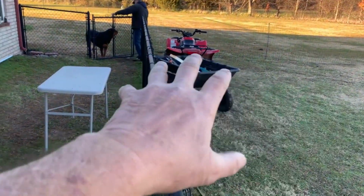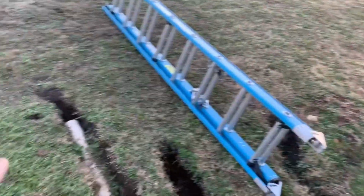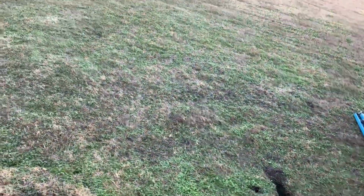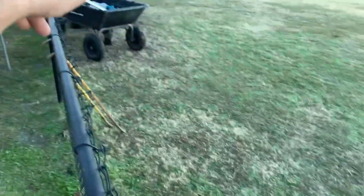This part is not going to happen until after the block wall goes in. This part over here, though, once we get the main water line that's coming around the house, and I can get all the other French drains hooked in, I can have this come out to a lower spot with a pop-up and just have it all come out away from the house for right now. I can even run this pipe all the way down and get that part done, so all the water is pulling away from the house the best we can.